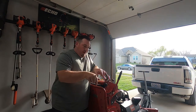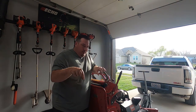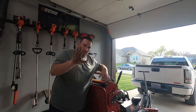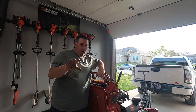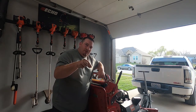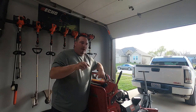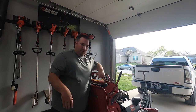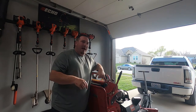But if you pull them top bolts, or them top caps on the hydros, out too far, then you could let enough air in there to where you do have to bleed them. So just loosen them up enough to where they just barely wobble. Because if you loosen them a lot, then they will pop out on you. You'll have hydro fluid go everywhere, and then you may have to bleed the system.